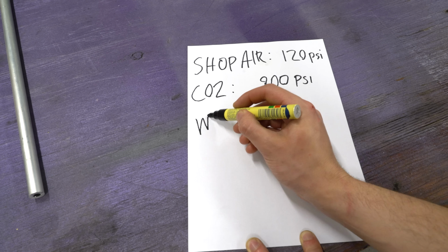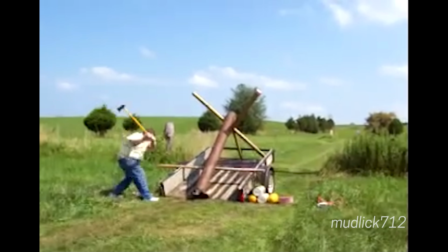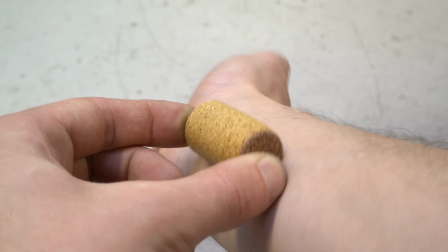No, I'm talking about air at like 4,000 psi, which is the kind of pressure that puts scuba tanks clean through brick walls. I reckon with this kind of pressure, I can get the launcher down to like the size of a wine cork. But to my knowledge, a tiny valve that can hold that kind of pressure and open that quickly and have an aperture that size just straight up doesn't exist and never has. So I'm gonna have to design it myself.